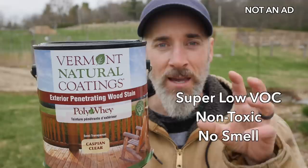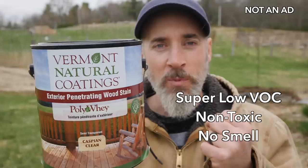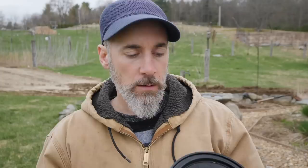You can do two coats immediately and then let it soak in and dry. It hardens up and doesn't change the color of the wood at all. This stuff comes from Vermont and the material inside is called poly whey — derived from recycled and renewable whey, which is a byproduct of cheese making. It's a durable, safe finish. It protects from UV rays, mold, and mildew, and it seals the grain of the wood so water is not penetrating into it.